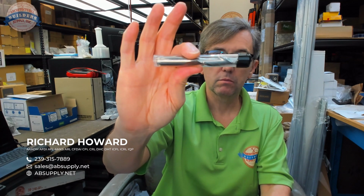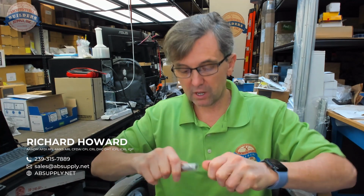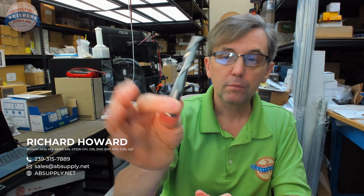This video is to bring you a closer look at the major HIT-45RB8 2-flute half-inch solid carbide, spiral up shear router bit is what this is. So this is a router bit made of solid carbide. It's going to give you the highest caliber of machine tools, short of getting into exotic material, of which I'm not an expert, diamond cutting and whatnot. Solid carbide is going to be extremely durable when it comes to your wood sort of mortising.